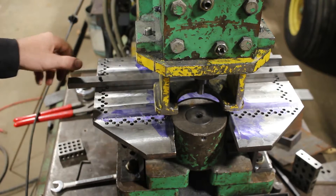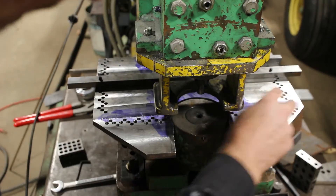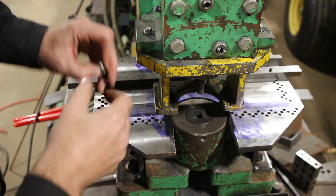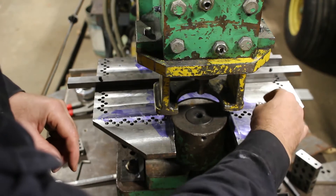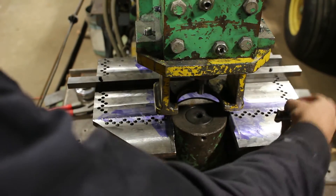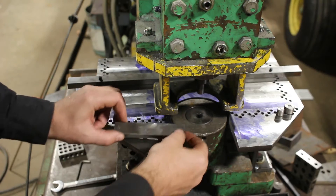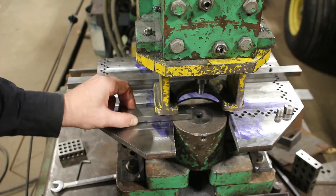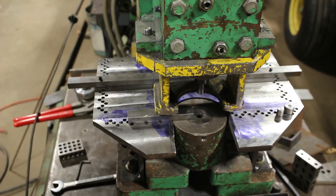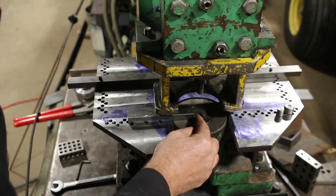I came up with this design where the holes are quarter-inch spacing along the table. I can use two different things in the holes: I can use this round pin and drop that in — that gets me a whole inch, so three inches from the center. I also have a pin that's slightly smaller; put that in and that is three and an eighth from the center, or whatever smaller increment. To get up closer to the center I made this bar — one side has a plus-one, the other has a zero. The closest I get is half an inch plus an eighth, so five-eighths of an inch away, or flip it around and that is one inch, so half an inch on center.